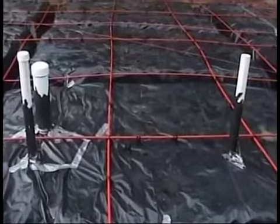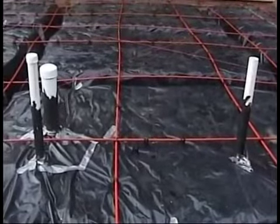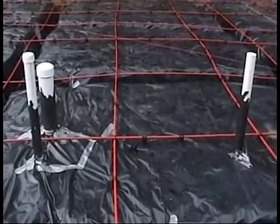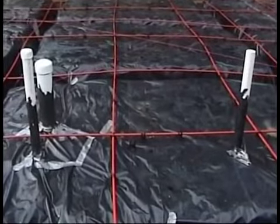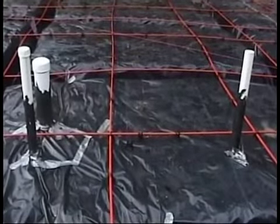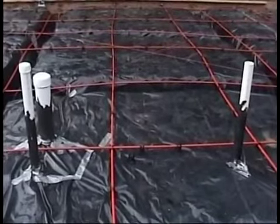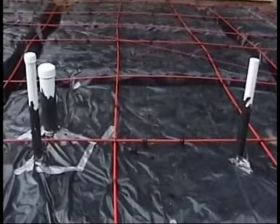The plumbing pipes, of course, are put in before the foundation is poured. The plumbing pipes have to be covered with a mastic, which is a tar-like substance, to a depth of at least 3 inches above where the concrete will be. The mastic is there to prevent water penetration, also moisture, and also keep insects such as termites from coming up through protrusions through the slab. Obviously, this needs to be checked to make sure it's mastic-coated before the concrete is poured.